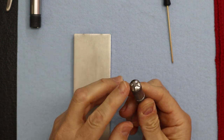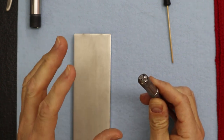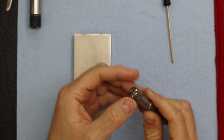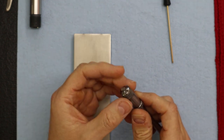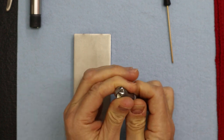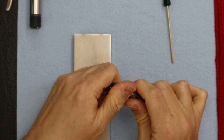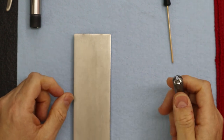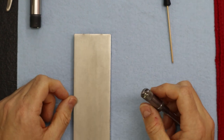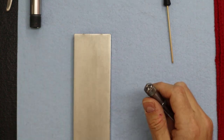And these are really nice. They just take your regular watchmaker collet, so you select the size you need and it's perfect. It doesn't damage the part you're working on, so that's why we like to use these. And the goal here is to get the most amount of life out of this little key we can. It's to get it to last as long as we can. That's why all the effort's being put in it. Exactly, we want it as perfect as possible.